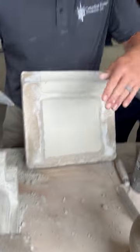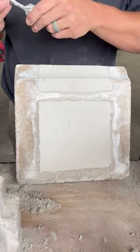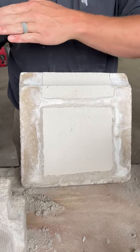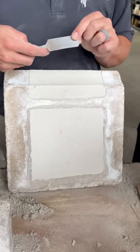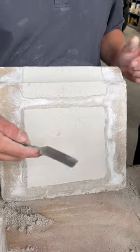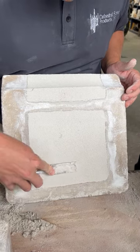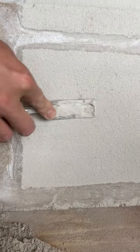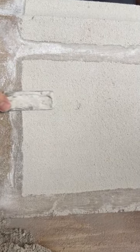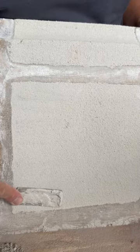You might be able to, on this one, actually see a color change. And this is also something that is responsible for color issues, is texture. You take a tool that's clean, and again, I don't recommend steel because you may see some of this carbon come off the tool. Hopefully you can see it in the camera, it's harder for me to see it here. But you're actually pressing down those little grains of sand.